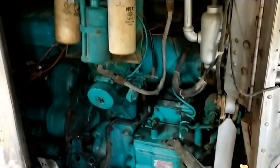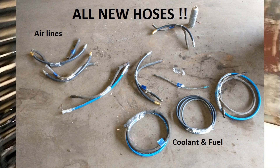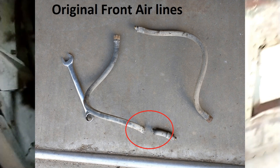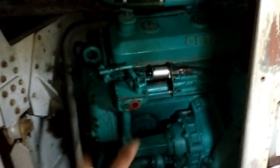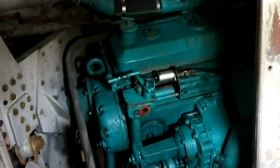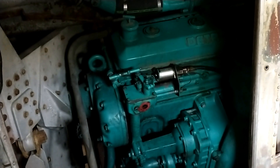The front diaphragms are in, the rear ones we still got to put back together. We pulled some of those hoses off back here. We're going to do the governor drain mod like we did on Sage's bus, like Scott recommended — basically you flip it over so it's pointing upward and then you put the drain breather tube on. A lot of oil flows through that governor and it just prevents it from leaking out. If you watch Sage's Bus Grease Monkeys video, when we climbed the hill we dumped a bunch of oil because the hill was so steep it was just pouring out that governor port.